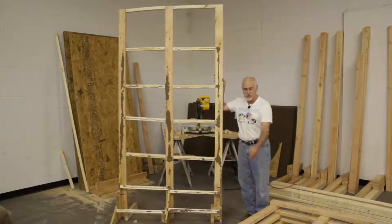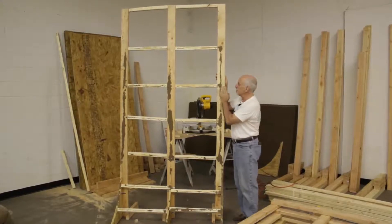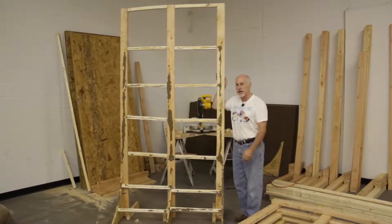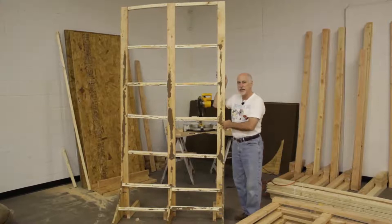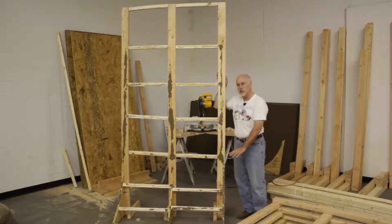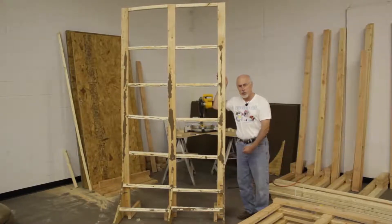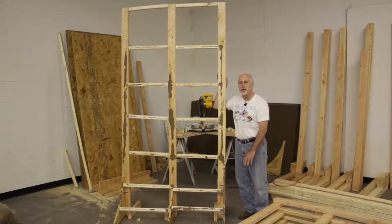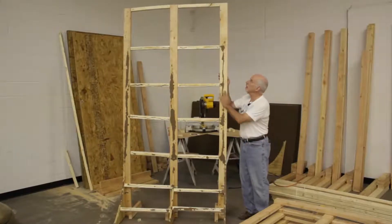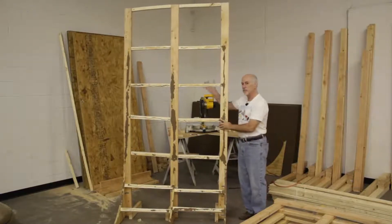It's obviously taller — the 15-foot sections are — but we have cross braces made out of two by twos. We put construction adhesive on all the surfaces and then used a nail gun to tap it into place, so you had glue and nails holding the Masonite to the frames. As we got down into the curves we found that nails were not strong enough, and we ended up using Phillips head drywall screws sunk into the Masonite so we could mud over the top of them as well. Add a little more height, sheath it over with Masonite, and there's one modular unit — pick it up and carry it away.